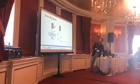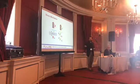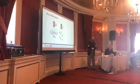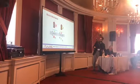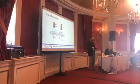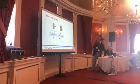Now, if you look into the buckling restraint braces, they have been proposed to solve the problem of buckling that we see in conventional bracings, but again, it yields. It yields in both tension and compression, which means, again, the building will most probably stand safely, but you will again have repair and maintenance costs. In extreme cases, you may have to demolish the building because it's no longer economic to repair it.